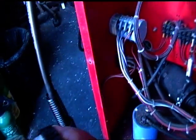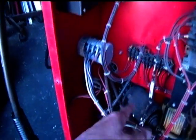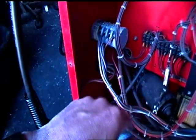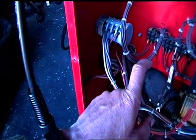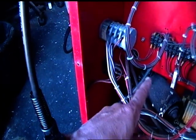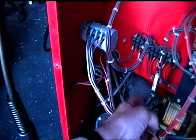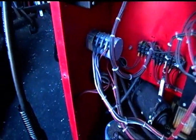here so that I can divert the power from that motor there to the socket on the front, and the switch is for switching the wire, the 12 volt supply, either to this motor or to the motor in the spool gun via a socket. Now, because I couldn't work out what the hell this plug was and find a socket to connect to it, I had to make a decision,